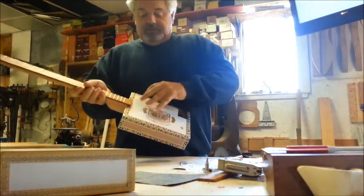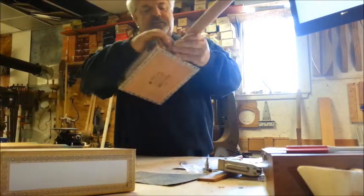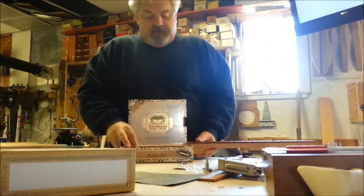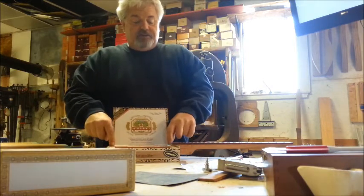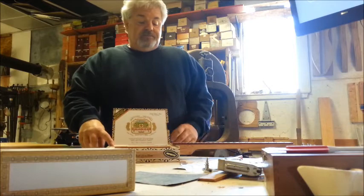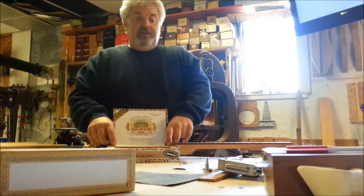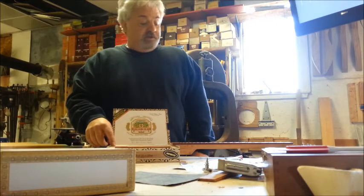When I do these guitars, in most cases if it's a guitar put together like this, I'll actually not glue the neck in the box. I'll take a countersink, a couple of screw holes, and put two screws in it — in some cases I only do one screw — but that's what holds the neck in the box. If sometime in the future the box gets beat up or broken, it's a real simple matter to take those screws out, take the neck out of the box, and rework it.